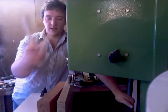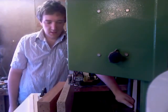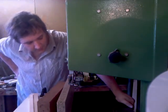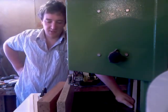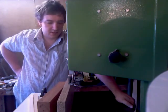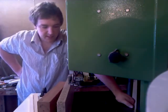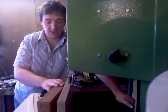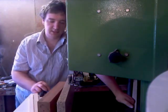We are going to use a couple of push sticks I made today. This blade is a 15mm blade — the big thick blades are much better for rip sawing, especially in hardwood. It is worth considering the teeth per inch: this particular blade is 3 teeth per inch, which is really coarse. That means it is going to cut the hardwood without heating up too much, cutting efficiently with a straight cut. It will be a bit rough but then you can plane it — that is no big deal.